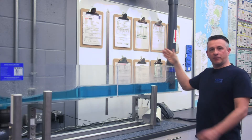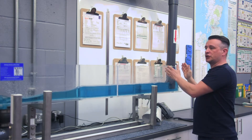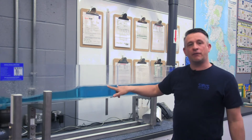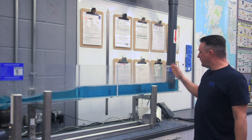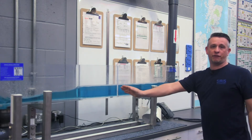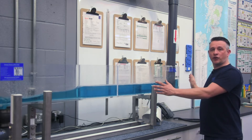Commonly people don't have enough space for an approach length and try to get by without a long approach. This means that the turbulence moves further down so you don't get an accurate flow. The introduction of penstocks to try and control the flow again has the effect of causing turbulence and swirl further down. So it's absolutely critical that you have a really good approach length.